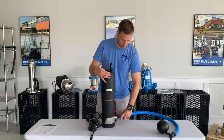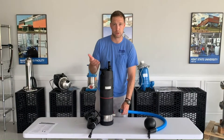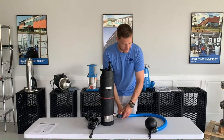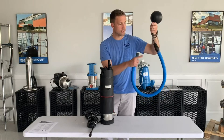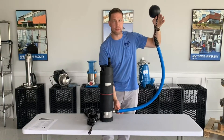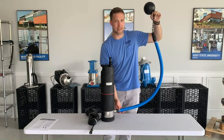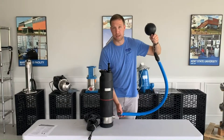Another really good feature for rainwater harvesting reuse — or really if you're just collecting any type of water into a storage tank — is an elevated intake point with a floating filter. They have a floating intake, which allows you to take water from the middle surface of the storage tank, so you're not at the very top and not at the very bottom. It just floats up and down — it's a built-in, integrated unit.